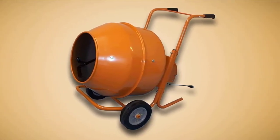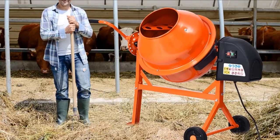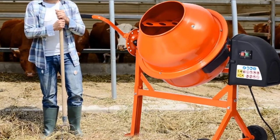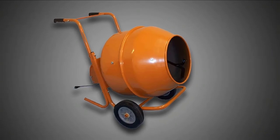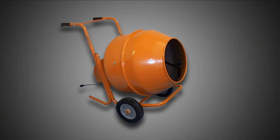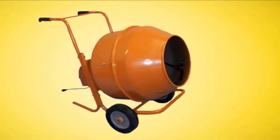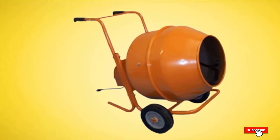This is a direct-drive unit without an offset gearbox, which cuts down on the overall weight. It's slightly underpowered with a half-horsepower motor, but the simplicity of design and function helps it work out well. The drum turns at just 23 RPM, which also helps take a load off the motor. The wheels are solid rubber — no reported issues with the solid tires, and at least you won't be stuck with a flat. The frame is strong with heavy-gauge steel and cross-bracing, and the grip handles feel good in your hand. The handlebars are adjustable.